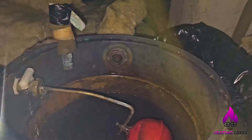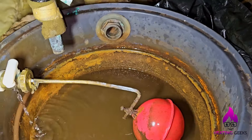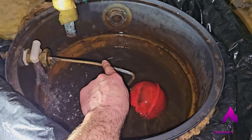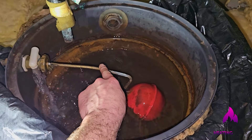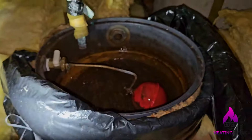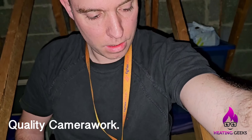Visually you can see exactly what that does. We are now dealing with a tank that is filling, still filling. We've now got our customer's heating and hot water back up and running. The boiler should not be overheating now. Maybe when we go back downstairs the boiler stats will be working. The reason I bring two canisters up is sometimes they will airlock or mess about again - worst case scenario that bottle of CO2 has cost me about three quid. But it saved me two hours. That's how I solve a blocked cold feed quickly.